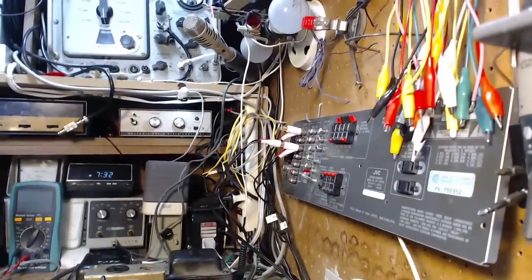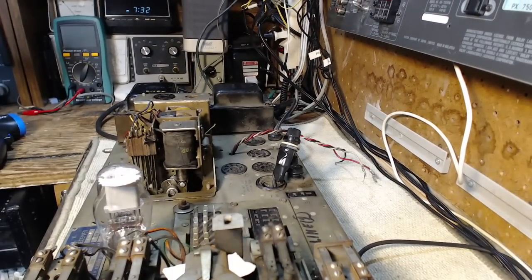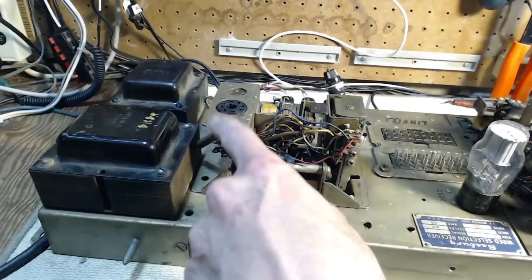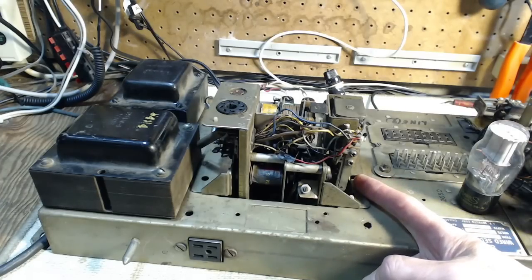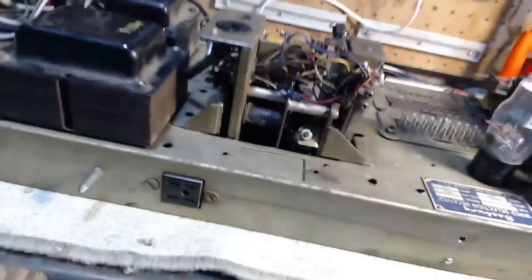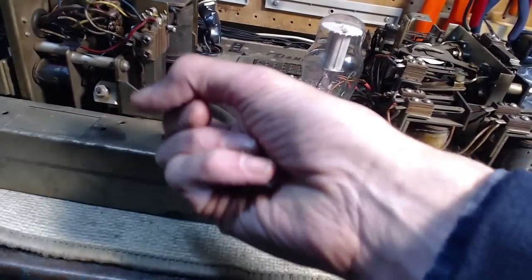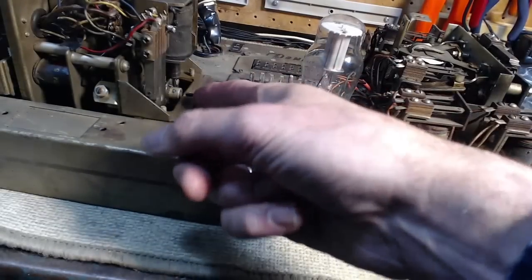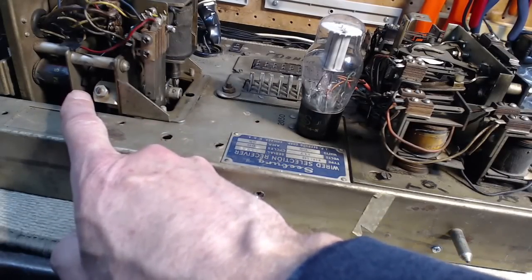Remember, I bumped a bunch of wires in there. Perfect. So I think what we'll do is we'll push that white button, which is supposed to imitate a coin coming in. So what should happen is this big solenoid should jump. Can't quite see it on that camera angle. There's a big solenoid here. Goes up into this coil. That should jump. And this wheel in here, which is also very hard to see, should spin.